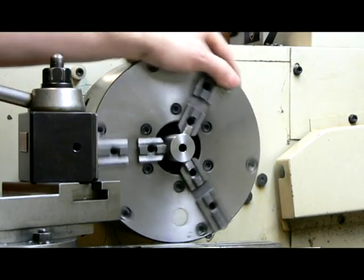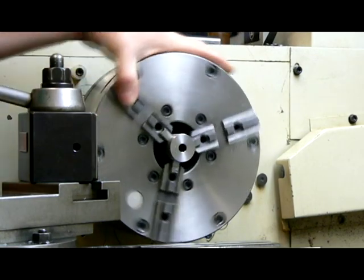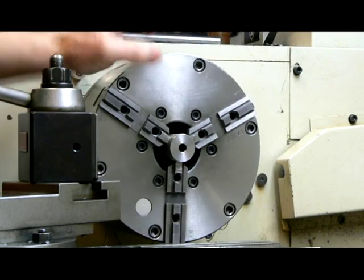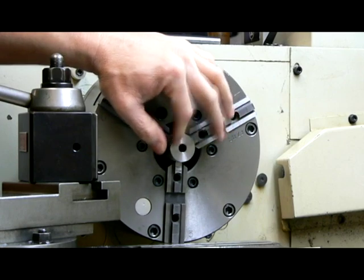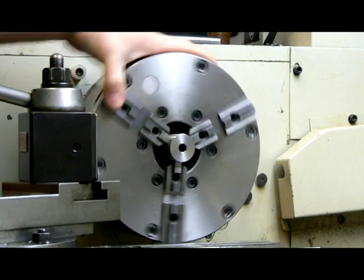All right, we've got this piece of 416 stainless steel on the lathe. It's going to end up going on a .45 caliber smokeless muzzleloader that I built. Right now it's a .350 diameter hole. This has come off of a .358 barrel blank on a rifle I built here in the shop.